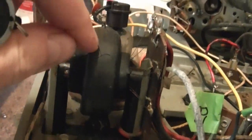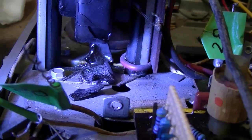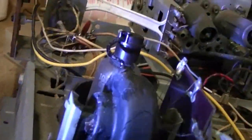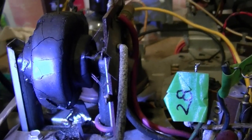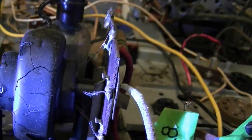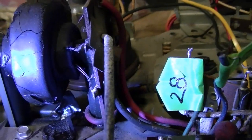The coating is not too bad - it's cracked and if I apply a little pressure I can flake it off, but down below things are a bit worse. Some chunks have actually fallen off and it looks like it's melted a bit and is stuck to the chassis. I'll clean that up. As far as recoating it goes, I think this is in decent enough shape to try firing it up, but once the set is running I'll recoat it. The question is whether to flake all this stuff off first or put the silicone over the remnants of the existing coating.